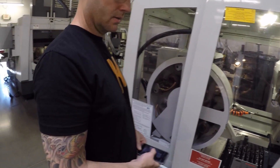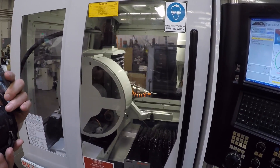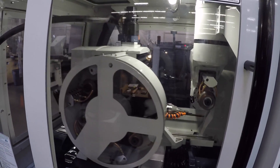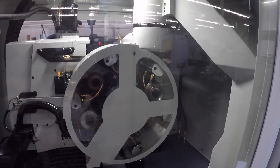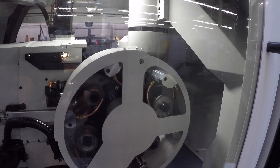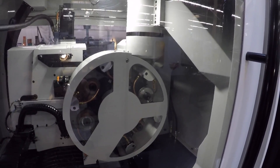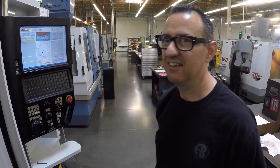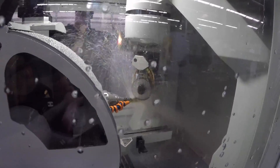The first thing it does is probe to find the end of the tool. I already probed the end and the tool change, so now it's going to do the first operation. Some people rough first, but unless it's a one-inch tool I just go for it — I can tell the machine exactly what load I want and it'll adjust the feed to keep it right there. You don't get as much load-up as you'd think.